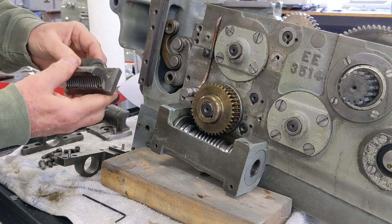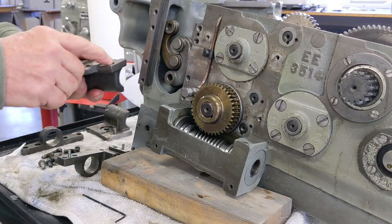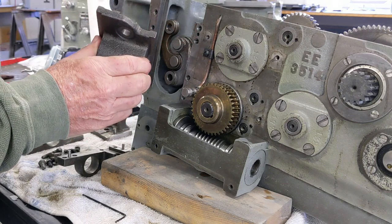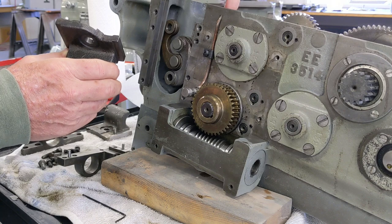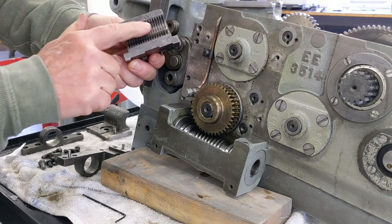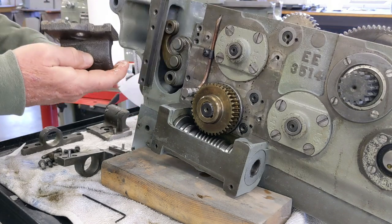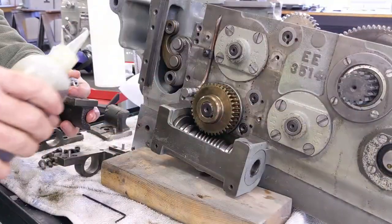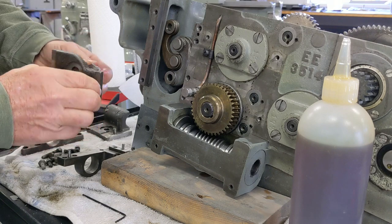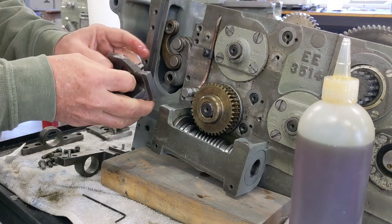This half also has an oil feed hole right here, and there's an oil feed hole right there. I can see a little port here that goes down, hits this hole right here, drips down, comes out here, and lubricates the half nuts. So I'm going to think that this will obviously be the top, and I'll get a little bit of way oil on here. I think the best way to get this in here is this way, because there's a washer and a nut to go on this side.